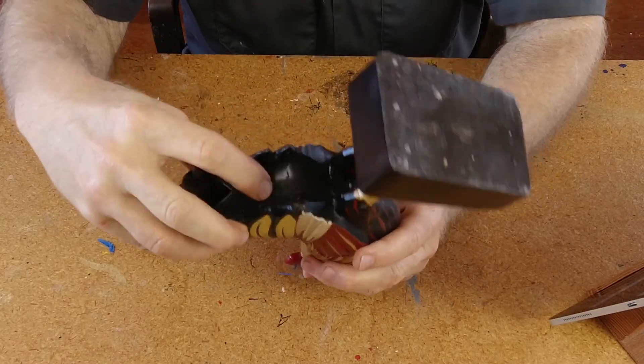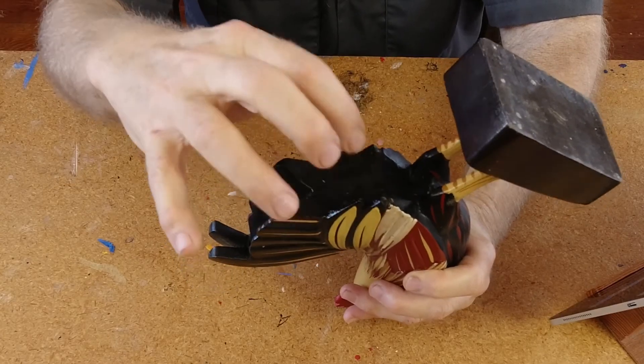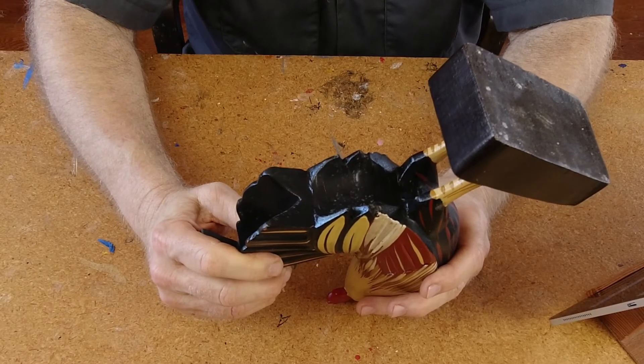The other thing I did was decide where to put the sprue to pour the hollow casting. You want it in an inconspicuous place where you don't have to spend a lot of time cleaning up. The most inconspicuous place on this casting is pretty much right here, so what I would do is drill a three-quarter-inch hole and put a dowel in there just as you see in the photograph. I would glue them in with wax, and I would also wax up the wood — because it's a wooden dowel — you always want to make sure that anything in wood is well coated in wax. That way there's no chance that the rubber or anything else can stick to it.